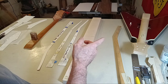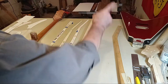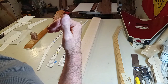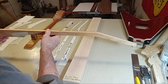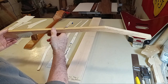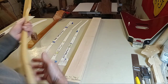If you were going to stay traditional Gibson, this is pretty important, I'm going to shoot from the hip here. If you go traditional Gibson on everything, and you move your bridge 1 inch closer to the end, please go with the shortest scale possible to control as much of the headstock dive as possible. If you went with a traditional bridge location and then a 25.5-inch scale, guess what you did? You moved your headstock 2 inches further out. I guarantee it's going to dive to the stage. It's going to be a nightmare. So make sure you go with the shortest scale possible on that guitar.